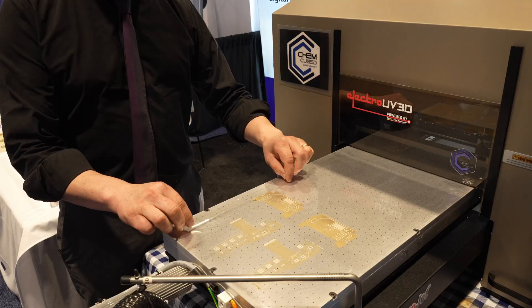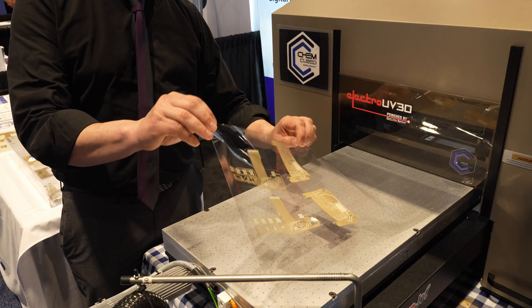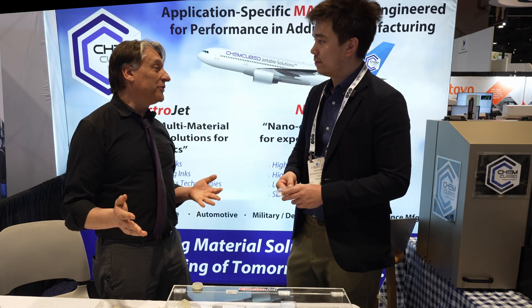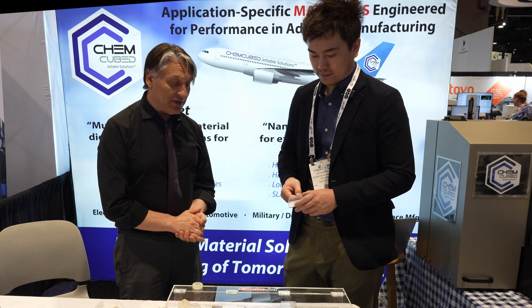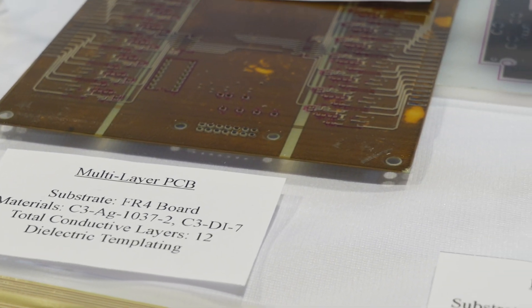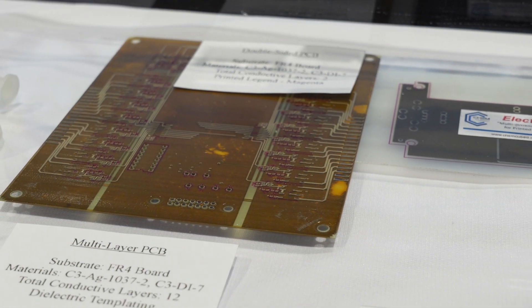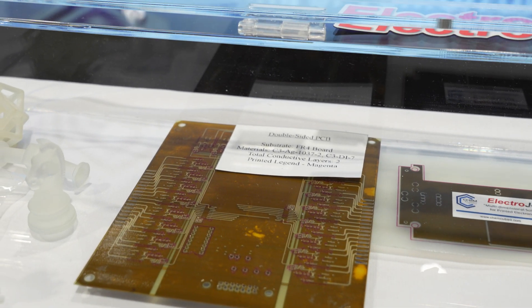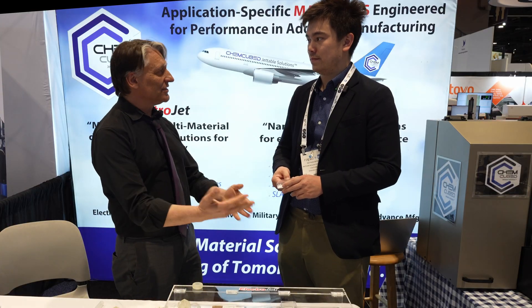These parts look pretty similar to parts you'd have made with a normal PCB manufacturing process. Are there any differences in minimum feature size, pitch, and spacing between features? This printer will do about 100 micron traces with a 300 micron pitch, leaving a 200 micron spacing in between. We're comfortable with that — it could do better than that, but that's what we shoot for.